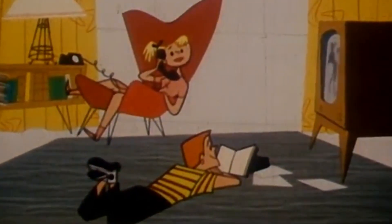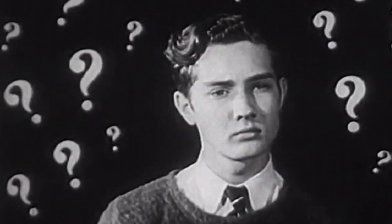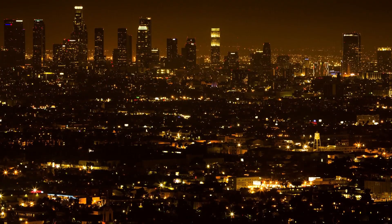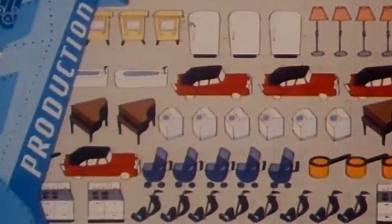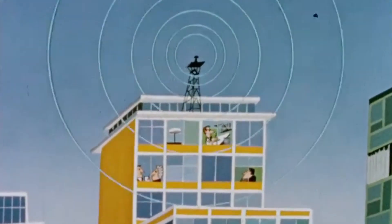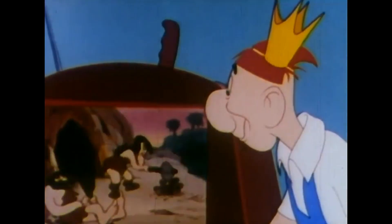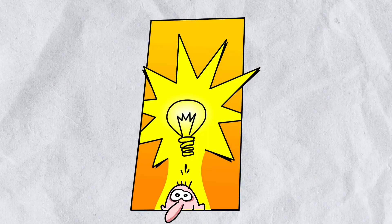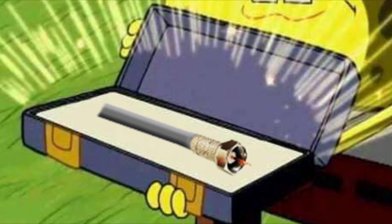Well, during the 60s, TVs were rapidly becoming very popular in houses. Facing high demand, companies had a difficult technical issue: how could you broadcast high-frequency TV signals from an antenna into millions of homes? It needed to be cheap for mass production, efficient with minimal signal loss over distance, resistant to electromagnetic interference, and it had to maintain good signal quality. An American engineer, Eric Winston, had the perfect solution — he came up with the F-type connector.